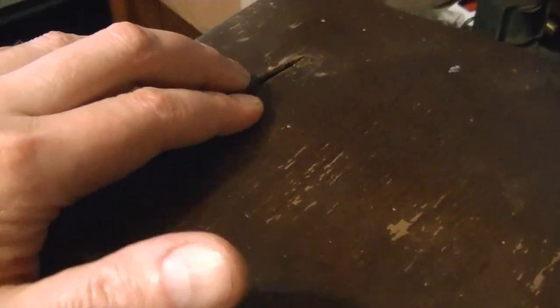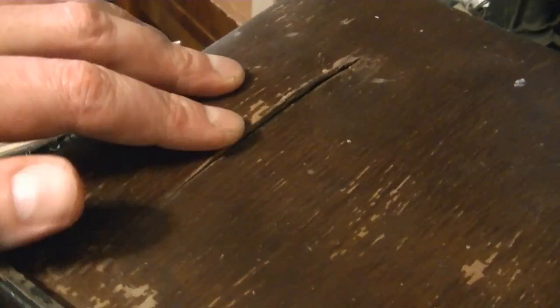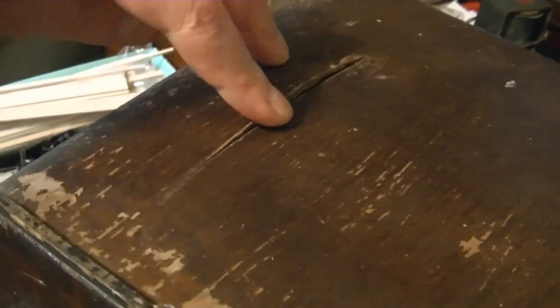Once that's done, the only major problem left with the cabinet is the split. I don't know what happened — this side must have gotten caved in at some point. Unfortunately, it must have been like this for so long that the wood has gotten permanently warped. I cleared away the debris and there's really nothing to prevent this from going back down level except that the wood is warped. I think what I'm going to try is soaking the wood a little bit, maybe steaming it to make it more pliable, then clamping it down to get these two sides level. Once they are, I can put a glue block on the inside to stabilize it.